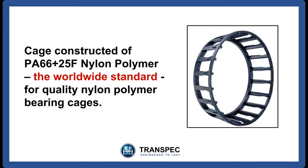Falling in line with the worldwide standards for heavy vehicle bearings, the latest design of BPW Genuine bearings utilize cages constructed of a high quality nylon polymer. This PA66 plus 25F nylon polymer cage allows for constant grease thickness on the taper rollers without the expansion of the metal cage due to heat.